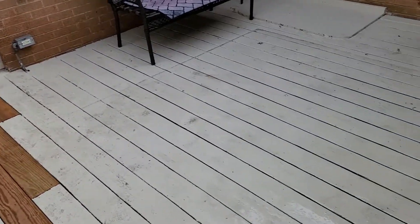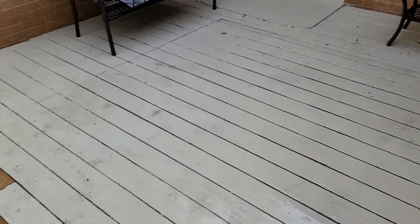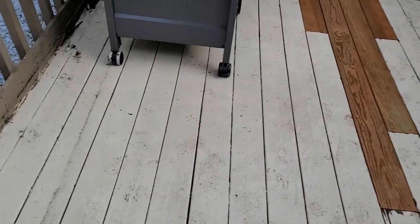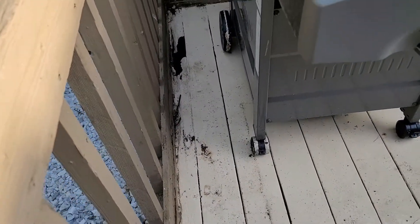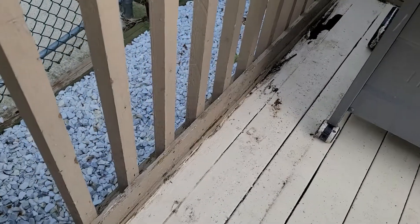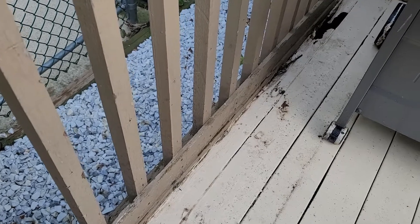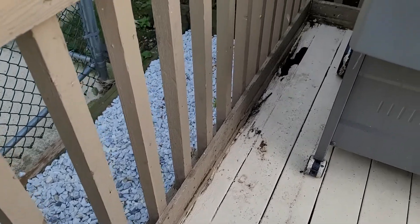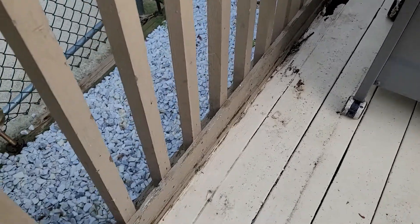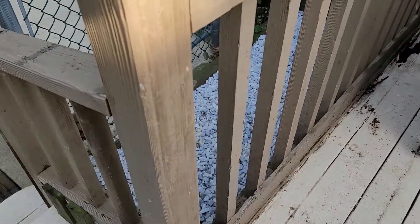The rest of the deck has pretty good integrity. We have one bad spot along this rail — there's a hole in it — and that's because the water was actually puddling against the design of this rail. Having a kicker along the bottom is incorrect; we need something with a two to three inch gap for the water to drain out. I'll correct that in the next video. Thank you.